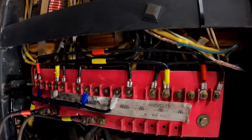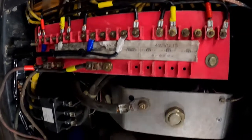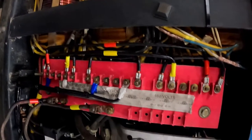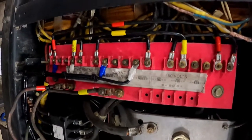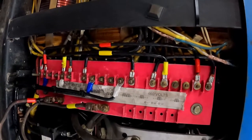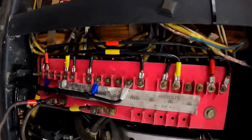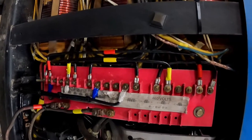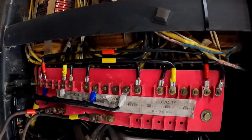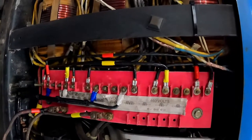This also means that the way I have it set up now, the front indicator will be true to the no-load voltage. So that's another confusing thing — you might turn it to 25 volts, put a heavy load on it, and you're actually seeing 23 or 24. The no-load volts is what's displayed on the front. You'll have to play with your settings a little bit. I use the Miller calculator on their web page — it's really good. You select what you're trying to do and it tells you the voltage, wire speed, type of gas, and what the amperage should be.